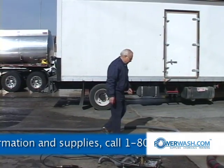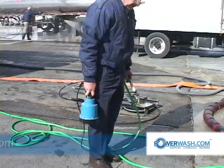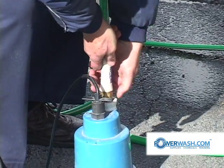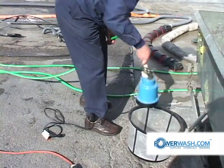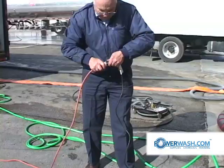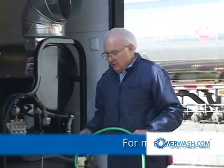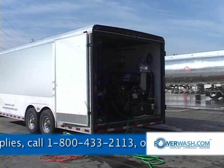The next way to pick up your wastewater is with a sump pump — it's a wash pit sump pump, WPSP. It's basically self-priming, and you've got a garden hose hookup to it. On a wash pad you're going to be looking for any place water will pool up, so put water in there. Start up the generator and the pressure washer, and then you can either discharge it to the sanitary sewer or discharge it back into your recovery tank.